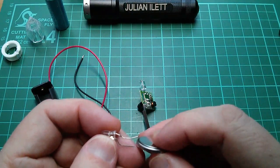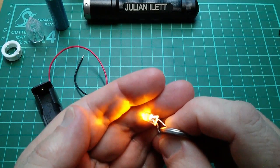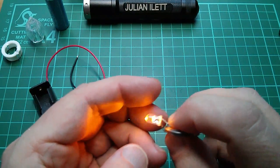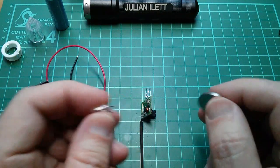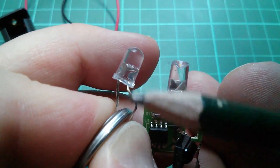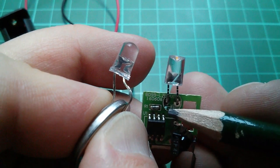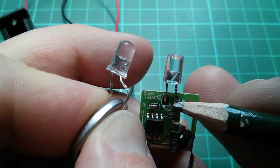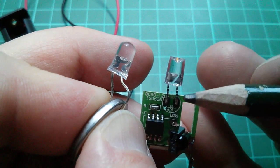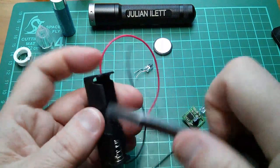The first LED will be this one, which I took out of one of those flickering LEDs. Yeah, that's flickering quite nicely. So I think I'll put this in with that current limiting resistor first, and then if it's not very good, I'll solder a blob across the current limiting resistor and see how we go. On the flickering LED, the anvil is negative. And on the standard warm white LED, the anvil is also on the negative side — that's the cathode. Current will flow that way through the current limiting resistor and down to ground. So I put this in with the anvil to cathode, same as this LED.